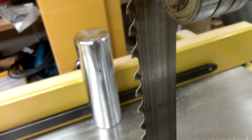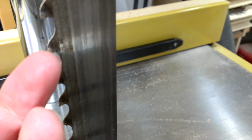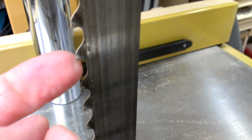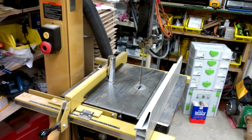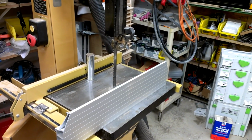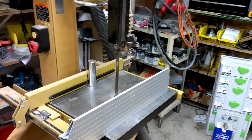Right now, I'll show you. I have a Resaw King in there, right there. It is a carbide tipped blade, not just a carbide impregnated blade, but it has little chunks of carbide on all the teeth, and it is awesome for resaw. It gives you a really nice, clean cut. I have had that blade since I got the saw, and I've run probably in the neighborhood of 1,000 board feet through it, and it's still nice and sharp. So really nice, good longevity.